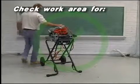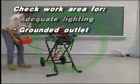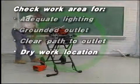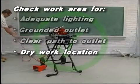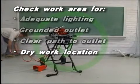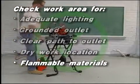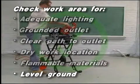Check the work area for adequate lighting, a grounded electrical outlet, a clear path to the electrical outlet, and a dry place for the machine and operator. Do not use this machine in standing water. Check for flammable liquids, vapors, or dust that may ignite. Place the machine on dry, level ground.